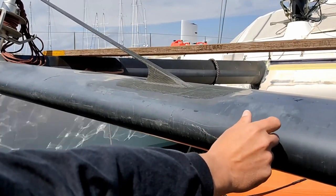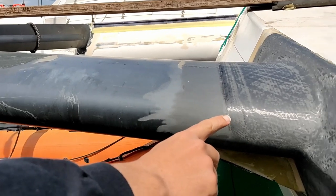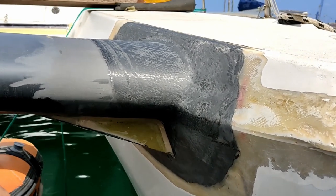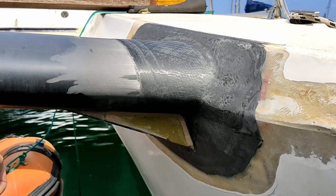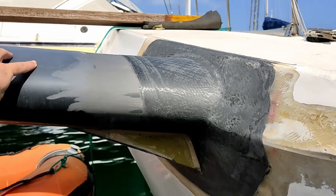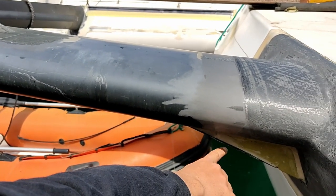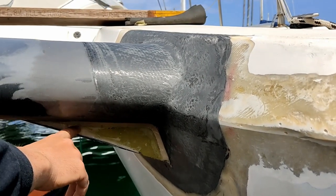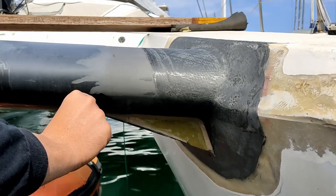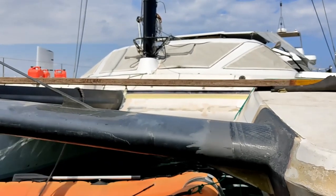The vertical component of the whole arrangement is being transferred into this socket. You can see this socket is substantially bigger than the six bolts that used to be there. We've transferred all the load into the beam area here through this martingale strap on the top — and eventually the martingale strap loads will be transferred into the bottom side of this beam as well. All the load in the martingale is being transferred in and around this beam, which is quite large and very stiff, so it transfers load very well.